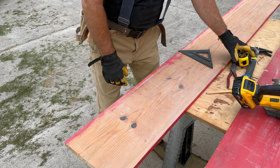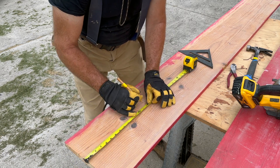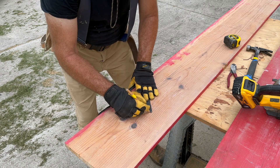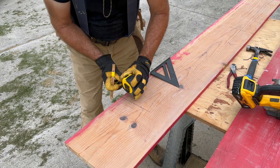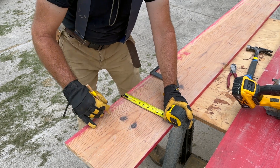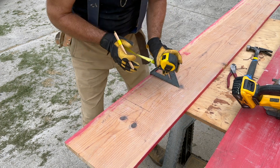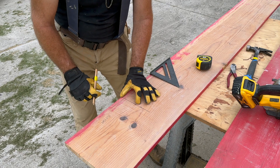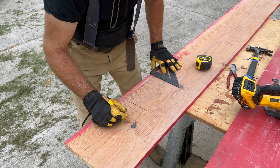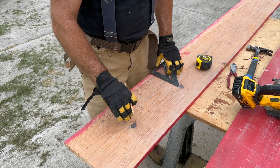To turn this old shelf into a panel for a chicken laying box, we're going to cut it to 13 inches. This is going to be one side of the box. We're going to use a 2x4 to create a lip around the front so that the chickens end up with a good nesting area at the bottom — coming up about three and a half inches to give a place to attach the 2x4. Then we simply cut an angle along that edge of the board. That angle makes sure the chickens don't have a flat spot to sit on, so they won't roost on the edges of the nesting box.